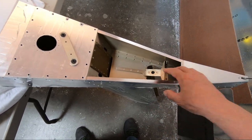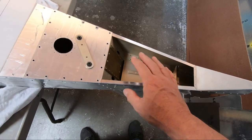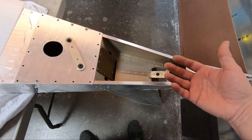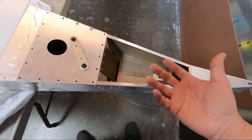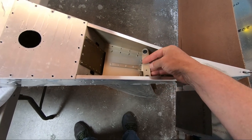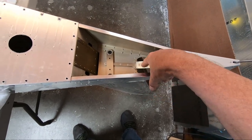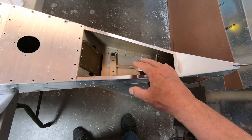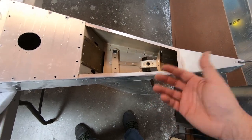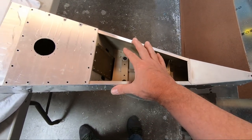The problem I have is there are several reasons that's somewhat of a bad idea. Any dust, dirt, and debris that comes in will get all over this Lexan panel and get very dirty on the inside over time. There's no way to take it off if I pop rivet this all the way around. The other issue is that not only are there bearings on the rudder cables, but now that I've installed a bearing on the lower mount for the rudder itself, I really need to get in here on an annual basis and lubricate these bearings as part of the annual inspection. Because I have to do that, it doesn't make sense to pop rivet this panel — I really need to screw it down so it's removable.